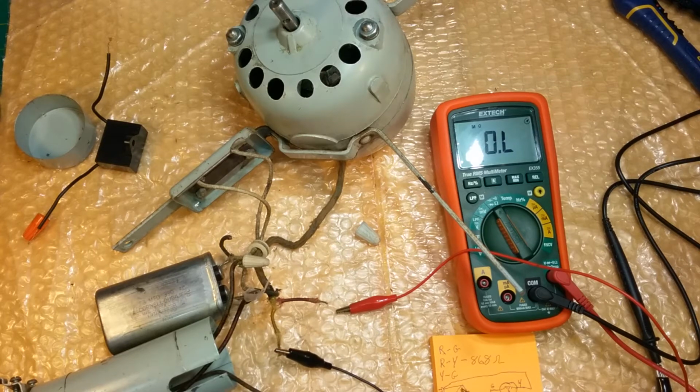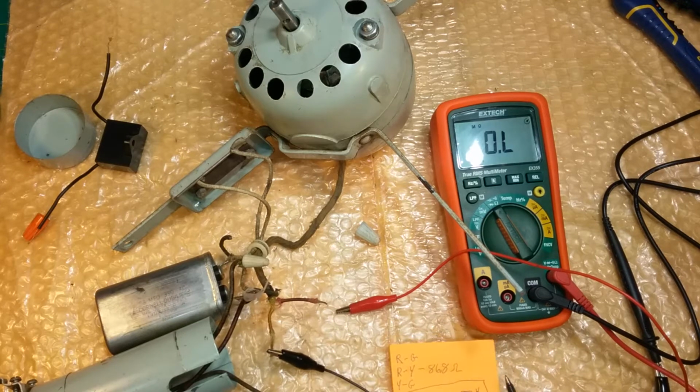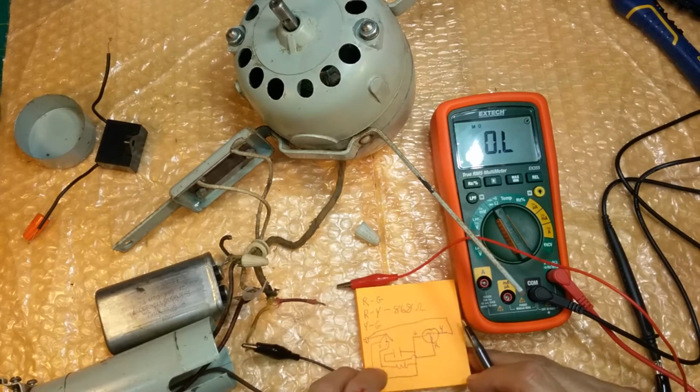Okay, so the power goes directly to this side of the motor. The other side comes, when it's on high, skipping all of this stuff, it comes right to the green side of the motor. So the AC is right across this, and there's a capacitor across this coil. Okay, when you go to 1, the capacitor is still across this coil. The AC is still going into, can you see that? I'm talking to myself. Oh, I am sorry.